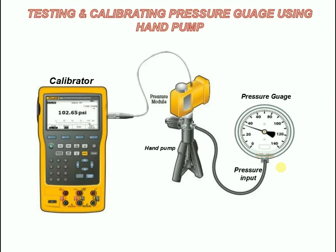The pressure can be fine-tuned with the vernier knob. To increase pressure, turn the vernier knob clockwise. Turning the vernier knob counter-clockwise will decrease pressure. Compare the reading of the gauge under test with the master gauge or calibrator, then calibrate the gauge according to the error.